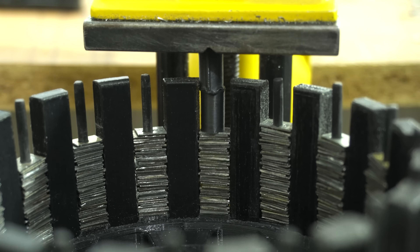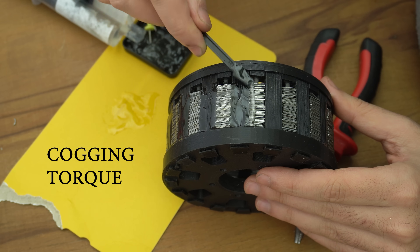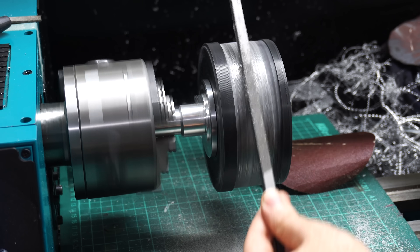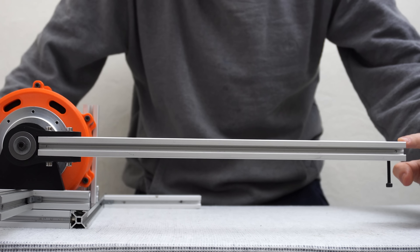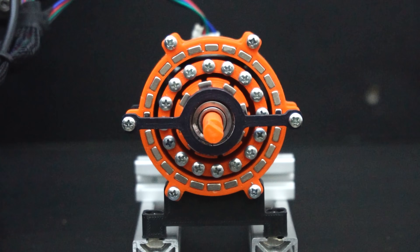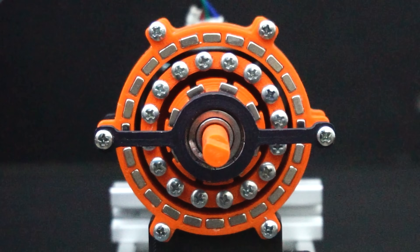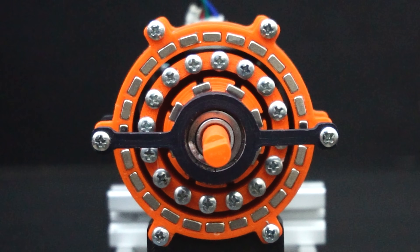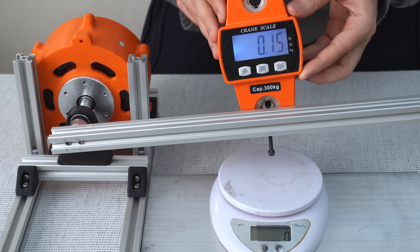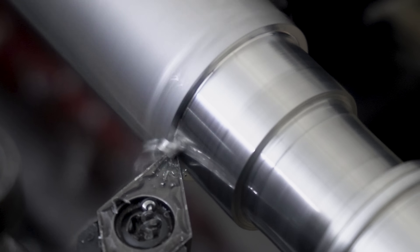It was quite long and tedious but that's the only way to prevent overheating, which is probably the only way to destroy this gearbox. Having 17 poles explains the odd gear ratio of 5.67. The reason for this oddity is to minimize cogging torque — you can feel cogging torque in any motor with permanent magnets when you turn the rotor by hand; it feels like it's sticking and opposes your motion, especially noticeable at low speeds. In this design, a simple cogging test showed only 0.1 newton meter, which is less than 1% of the slip torque despite the powerful magnets used.